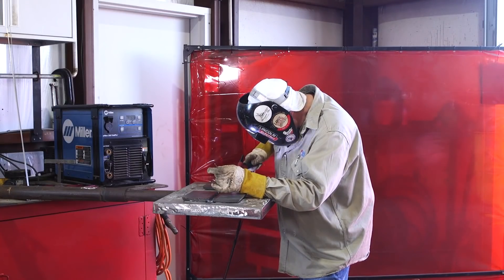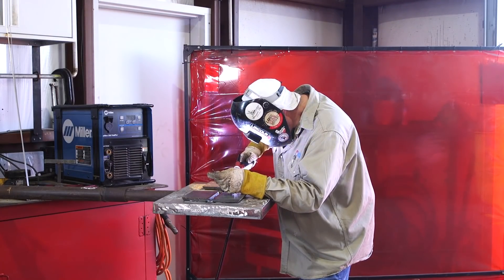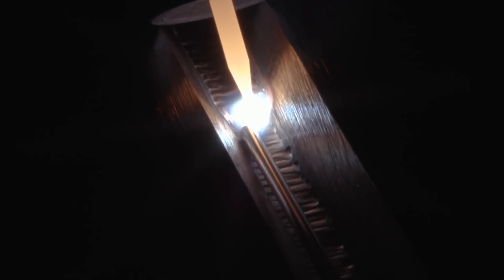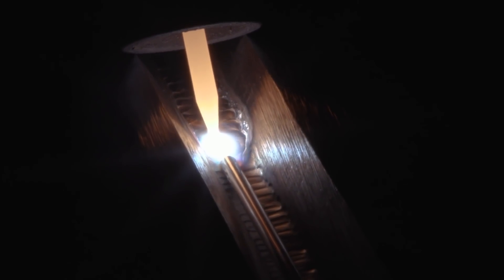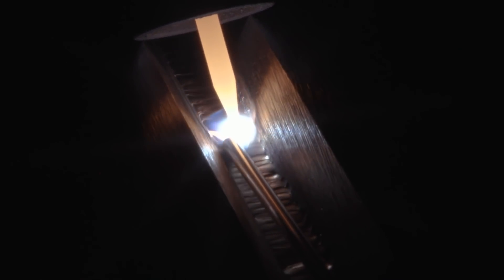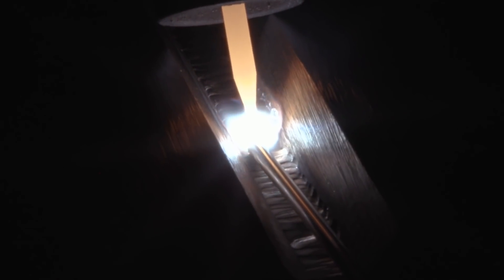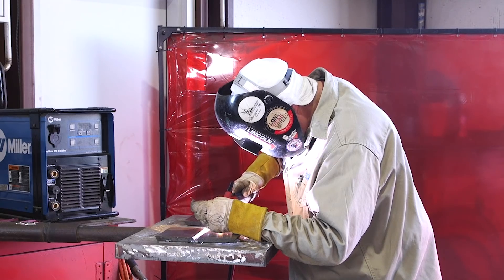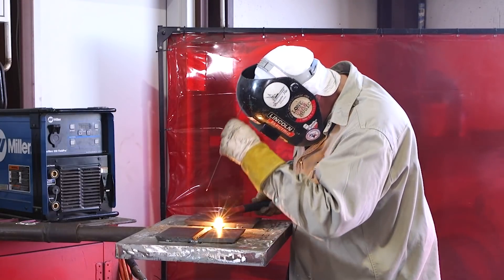We've run one or two passes with the copper coated wire. We're going to run some passes now with the copper free coated wire — but let's be clear, there's no such thing as copper free wire. TIG wire has to have the element of copper in it or it cannot be sold in the United States. What I'm seeing in the puddle right now, there's really no difference — no trash, everything's wetting in nice. Amperage is your friend with TIG welding as long as your travel speed is where it needs to be.